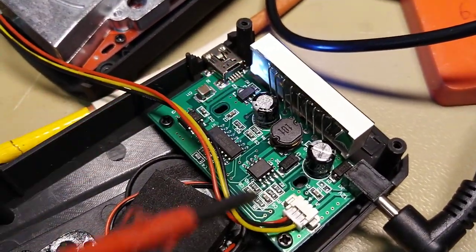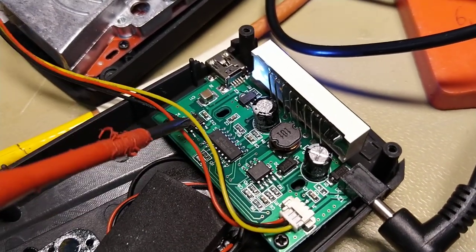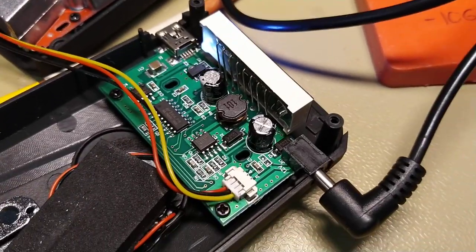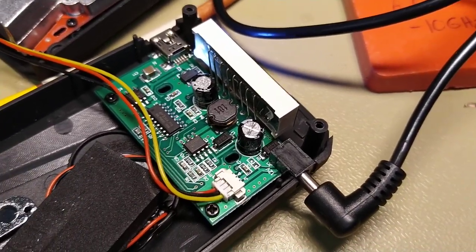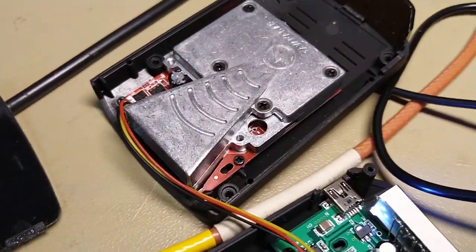The display driver is likely beneath the board because this is the sound output chip and there is a small EEPROM for some configuration stuff likely, so that it remembers the settings when you turn it on and so on. So I'm gonna tear this open and then continue.